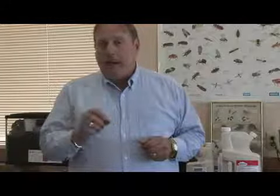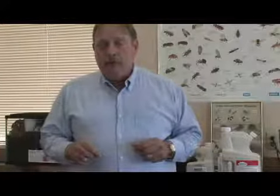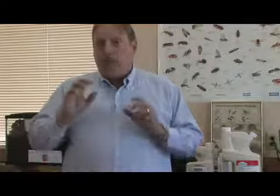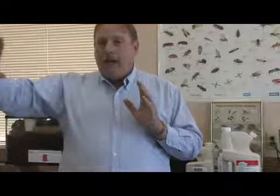It's a very effective treatment. However, if you have drywood termites inside the pole barn, that will involve a different type of treatment. That may include a foam application on the inside of the structure itself, using the same Termidor product mixed with a foaming agent. Under pressure, we push that inside the actual wall void of the pole barn structure itself, if there happens to be a void.